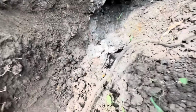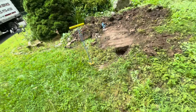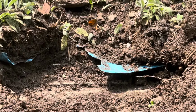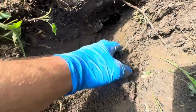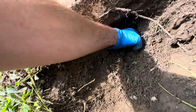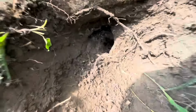It's got the signs of effluent. Soap and grease. Haven't flushed the toilet. Inlet. No outlet cover. You can see how moist and black this dirt is. This pipe is collapsed some time ago. Just been draining out slowly through this little hole, little opening.